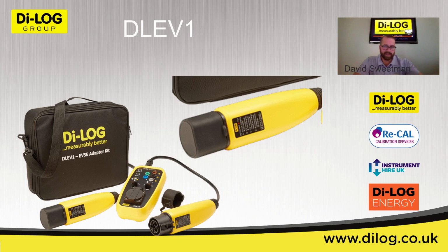And most importantly, you've got a PE pre-test, which is a little contact electrode on the very top of the instrument, and this indicates if the voltage or the potential voltage between neutral and earth does end up above 50 volts. So by placing your finger on that, it will enable you to indicate that the earth is present, and use the test to earth for you to actually indicate if there's a potential risk as well. But each of these tests and indications are all identified on the very top of the adapter there.